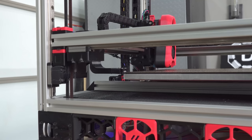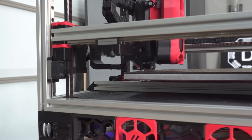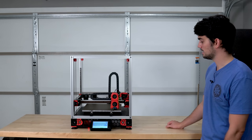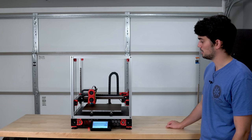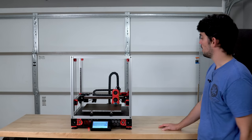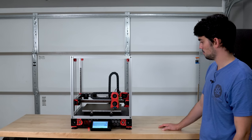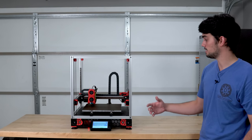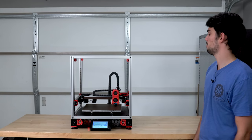The first thing the printhead will do is go pick up Clicky, which will tell it how far the printhead is from the bed. It's going to check that distance for all four corners. It's then going to take the difference between each corner and use that information to change the height of each corner. It will repeat this until that trigger distance between each corner is within some small error.